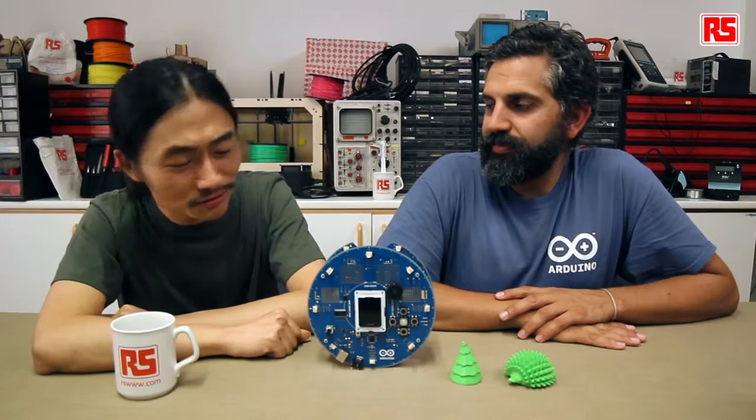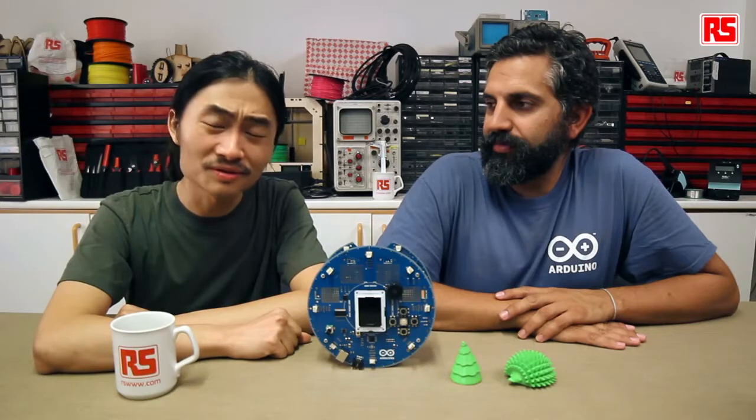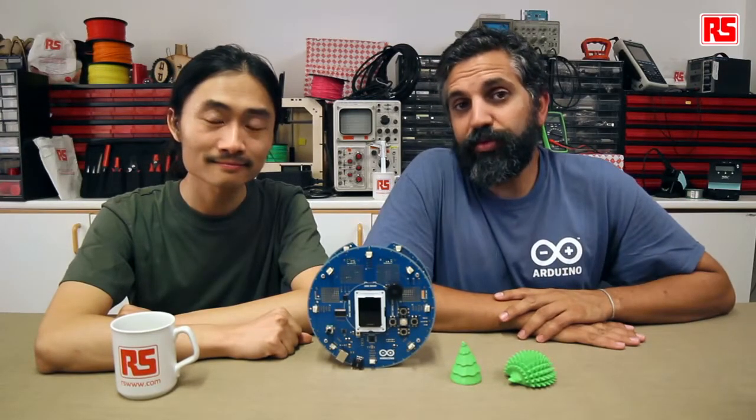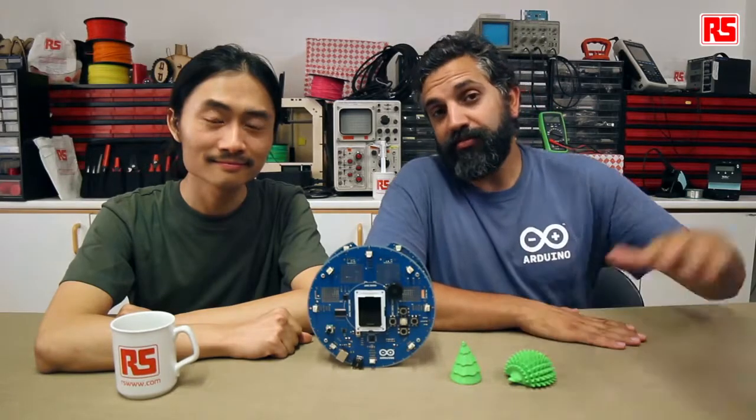In today's episode, we showed you how to do the line following example. And thanks to our two green friends, we also did the rescue example. We also showed you the mathematical algorithm of PD control. If you are really interested in robotics, you should also look into the PID algorithm, which is a bit more complicated but enables you to do more powerful things with the robots. This was our fourth chapter about the Arduino robot. We hope you liked it — see you soon.